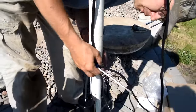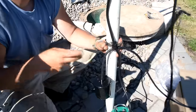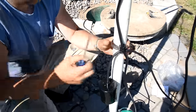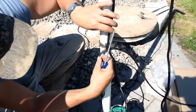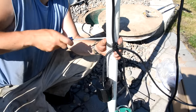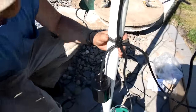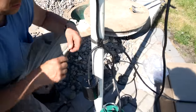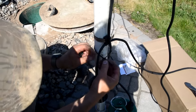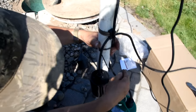I had taken some good measurements from the previous pipe when I took it out. I was originally going to mark the pipe, but it was so full of septic slime that I couldn't get anything to mark it with, so I ended up taking measurements and writing them down. This whole process cost around $500 — I think the pump alarm and floats were about $80, and the pump was around $450. Hopefully it'll last us at least another 11 years.